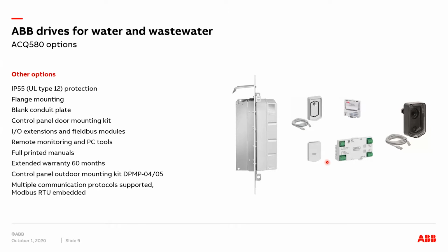So if you've got a big MCC, that'll be on the panel door, because what happens in the past, and I've seen it before as well, and a lot of you guys will agree, is if you don't have that, and say for instance on site, the guys want to see if the drive is tripped or they want to change something, they actually open up the panel door. And sometimes what happens is they'll make the changes, they'll see if the drive's tripping, and the panel door doesn't always get closed. It might be slightly open, and then you'll get all this dust floating into the panel, and then you'll start getting issues like your fans clogging up. So if you have this door mounting kit, that just makes it a lot easier. You don't have to open up the panel to see if the drive is running, if it's tripped, etc.